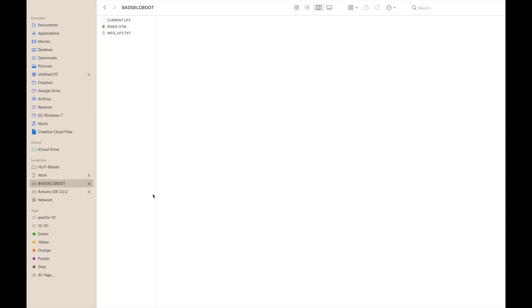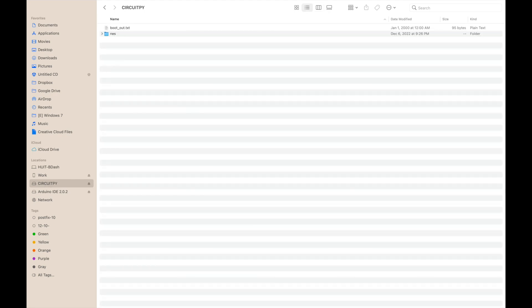Initially you put the Pi Badge in, you double-hit that reset button to get it into the Pi Badge loader for the UF2 files, and you drag and drop it right here. You can see I've already done that. Now that you've loaded the UF2 file, you hit the reset button and it takes you back to kind of the standard Circuit Python load.